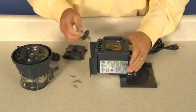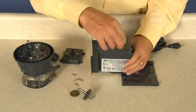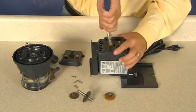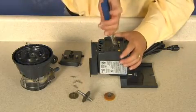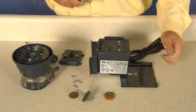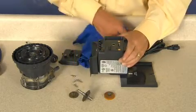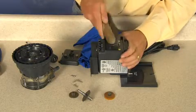Remove gears and inspect the post. To remove the post, grasp with pliers and pull straight out. Wipe away old grease. Check for rust or corrosion on the rotor shaft and remove any visible rust or corrosion with a wire brush prior to replacing gears.